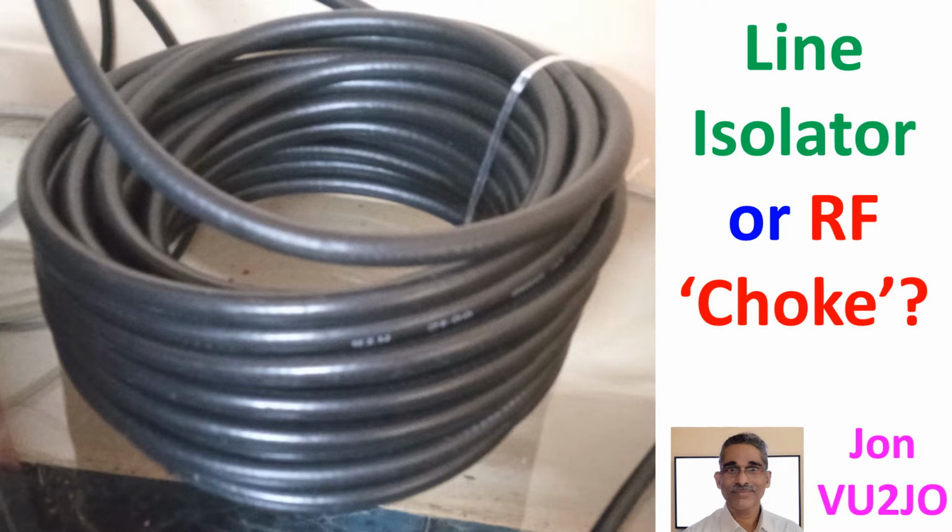I had tuned the antenna by trimming it for the lowest possible SWR on the 7 MHz band and got reasonable levels, up to 1.2:1 at the lower end of the band, while it was 2:1 at the higher end of the band. It was then that I noticed that both the forward power and reflected power shown in the SWR meter were very low. It was much lower than the power that I had set in the radio.